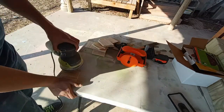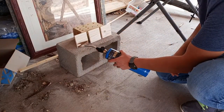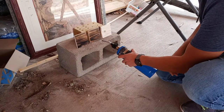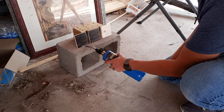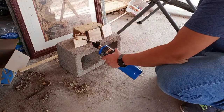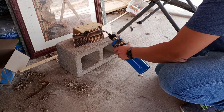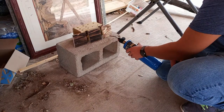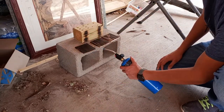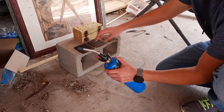After all the edges have been sanded, you basically have finished blank coasters. From this point we're going to be burning them. I have a propane torch and will do some even passes over the coasters to get that darkening of the wood. You don't want to hold it in any one particular place for too long because you'll get uneven burning. Steady, even passes — don't hold it on any one spot too long and you'll get a nice finish.